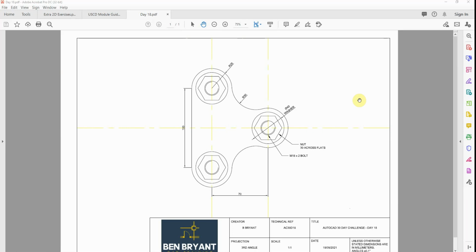This is today's challenge. This is like a 3-part little bolt system, which is like a supporting little flange clasp. Basically 3 bolts, so you could basically connect 3 bits of strut together. So this one is fairly basic on the dimensions. It's 100 center, 70 then between the verticals, so left and right, and you have obviously 100.